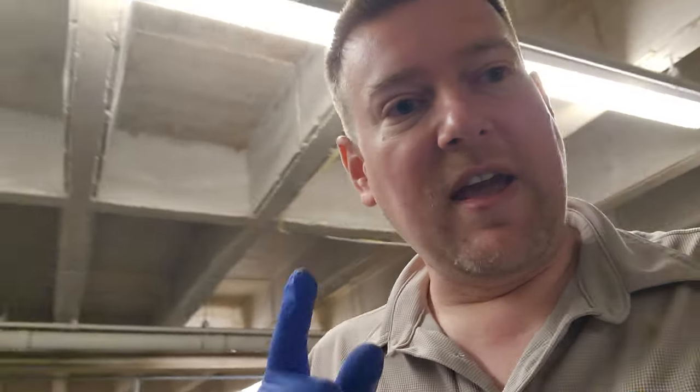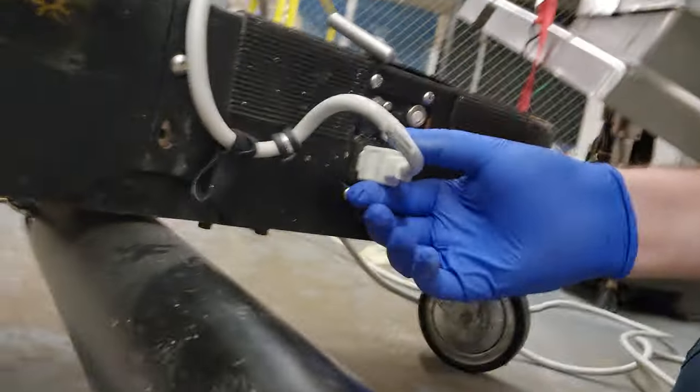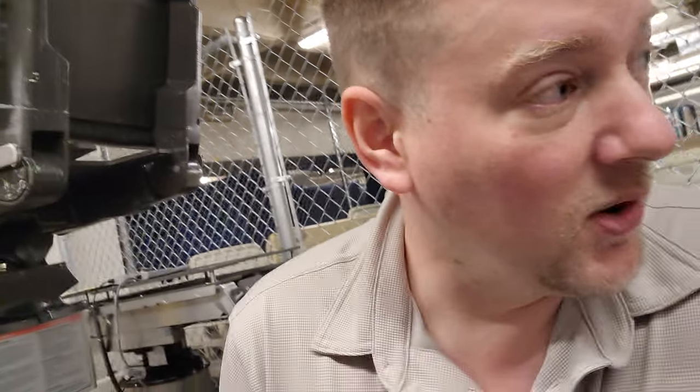One of the first things you have to make sure is that the table is fully charged. That means you start at the power cord and check for power cord retention. We've got a whole series of them to work on here. Before you start working on a table, make sure it's plugged in, it shows it's charging, and the power cord has appropriate retention on the pins. If it doesn't, replace the power cord. Let it charge for a bit, then start diagnosing — especially if it's a charge error or low battery.